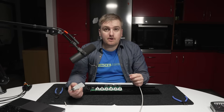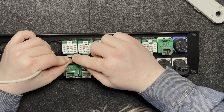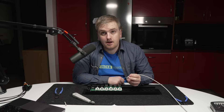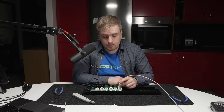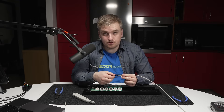I did see on Reddit that apparently A is also used somewhere. Normally these would have a small clip that would go around, which would be the shield of the cable. This exact cable is not shielded, but to pass audio — especially if you want to be able to pass phantom power — you want to have shielded cables. It will work without it but it's definitely better to design it to use shielding.